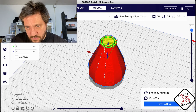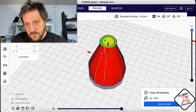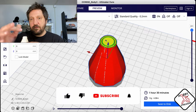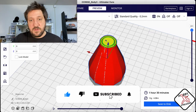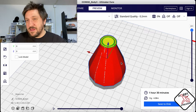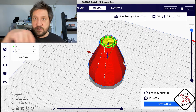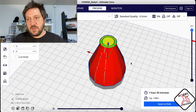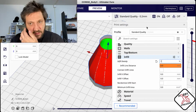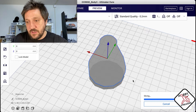It's fine going up, it's fine, until you reach around layer 311 - all of a sudden you have an area in the middle which is basically underneath an overhang. If you try to print it, it will just print in midair. If the gap is small enough it might work, but if it's trying to print in a circle it's gonna print in midair.